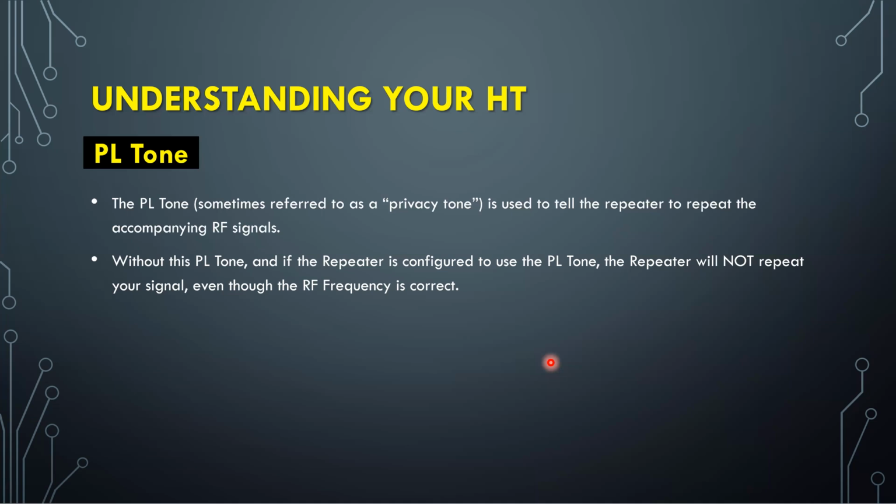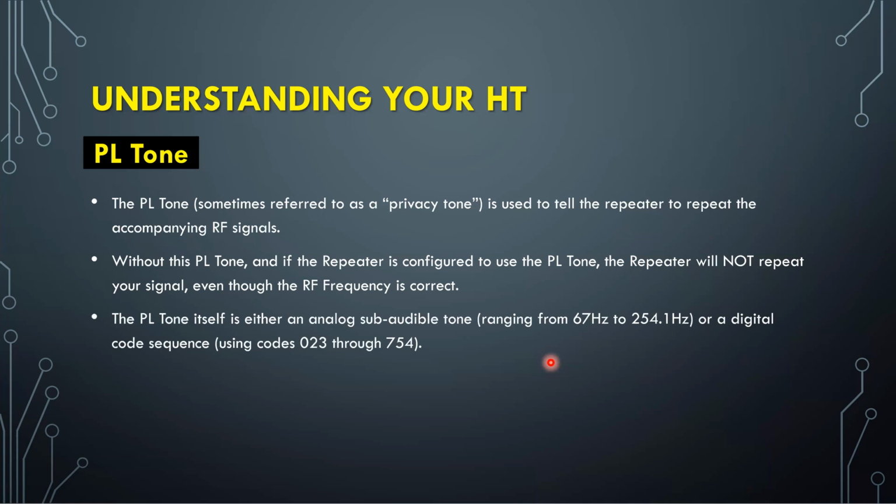Yeah. My original radio didn't have... The thing that I am on, okay, so not to complicate things, but this is ham radio. We have analog PL tones. As a matter of fact, I think that's on the next one there. We have analog PL tones and we have digital tones. And digital really isn't a tone. It's a digital code that gets sent out. And I do not know if that is a continuous stream. I do know on the analog side, it is continuous.